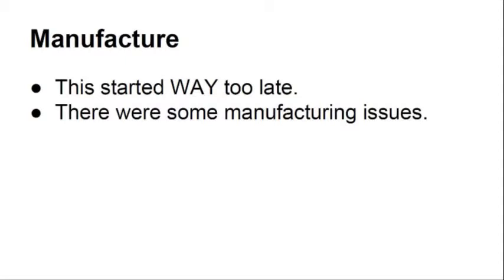Well, the basic reason for the fact that they're red and not orange is a mislabeled batch of ink that arrived at our factory. Along with everything else that had gone wrong on these guys' side, it meant that we had very little time to actually make bare boards and assemble. In an ideal world, for a batch this size, you'd probably have 2 weeks assembly time, 2 weeks manufacture time, if you're pushing at it quite hard. We didn't have that. So by the time the ink arrived, we were at solder resist stage of the process, and the ink arrived and had to go straight onto the boards. So at that point, when you open up pigment that's labelled as orange and it's red, you don't have a lot you can do about it other than put it down. So that's why you have red boards, not orange. Bare board manufacture is something we do every day. That part was relatively painless.